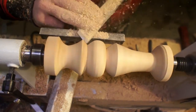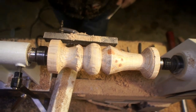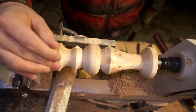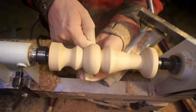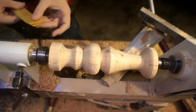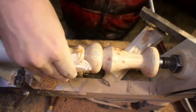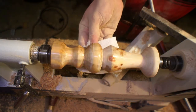Something people can in fact tell, though, is when it's a really rough finish. I was talking earlier about how the wood had gotten kind of punky sitting out, and you can see how I was just really getting a crappy finish off the tool. So I come back in with a scraper figuring that's going to give me a better surface finish, and it does — there's less tear-out. But it still isn't really satisfactory. Because there was so much tear-out, when I started sanding I started with 60-grit paper, and you can tell it really changed the shape of the spindle as I was doing it. But it did make the surface finish really smooth. I don't know if it's the really soft wood, if my tools aren't sharp enough, or what — but the sandpaper did seem to make it acceptable.